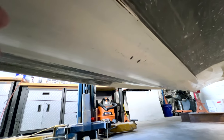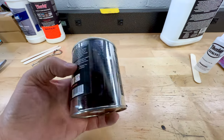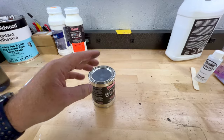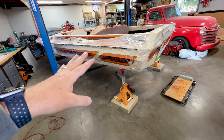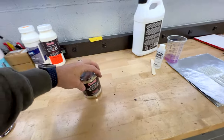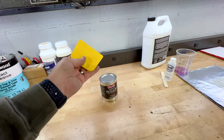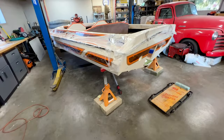The next step after the fiberglass resin is this fiber filler - structural fiberglass putty, almost like a fairing compound. We've used this in plenty of other areas on the boat: seating in the stringers, filleting all the edges. It's very strong. I can put this on without putting the resin on first but I do like putting in just a small thin layer of that resin first to help soak into any of the exposed glass to make sure everything's good and wet. Then once that tacks up I mix this up and put it on. Without further ado we're going to get the resin mixed up and on all those areas, let that kick off, come back and get this fiber filler mixed and applied - real thin, with a normal bondo scraper. Essentially the same thing you do with bondo - run it across the surface and wipe it flush so it fills those deeper voids without protruding.